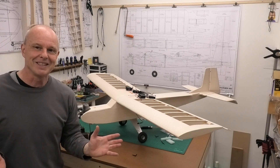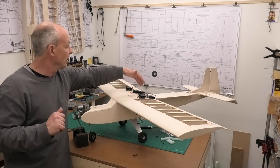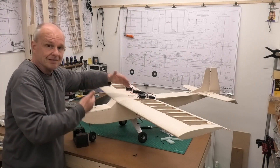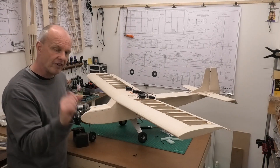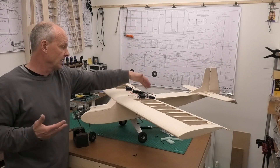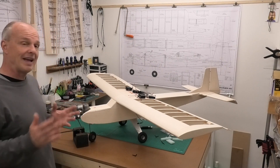I'm really pleased because I've got a good idea of where I need to put these servos and the battery. I'll put the battery as far back as possible but leave space underneath the servos so I can slide it further forward. Maybe if I put a lighter engine in I can move it a little bit further forward, but it will give me that fine control. One of the engines I've got is a little bit heavier than this, so I'll put everything as far back as possible and use the battery position moving forward as that fine control.